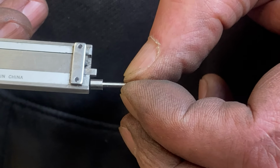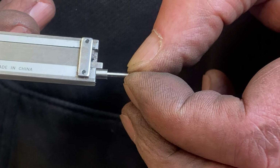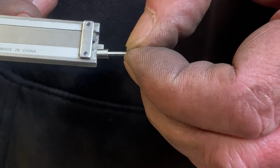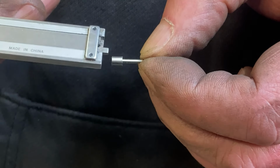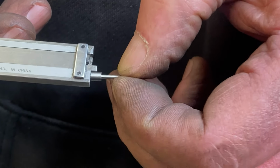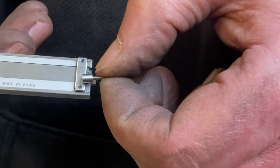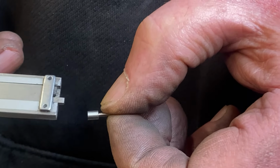So now I'm going to put it back in the machine. I've got it to length, and this length worth needs to be brought down to this diameter. And so that's what I'm going to do next. I'm going to put less than this little bit here in the collet and leave this much and a little more sticking out.